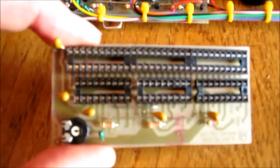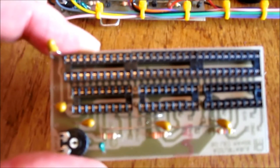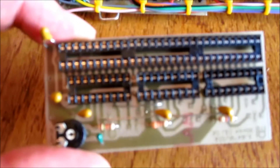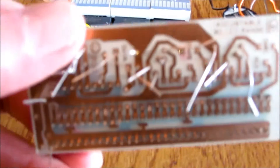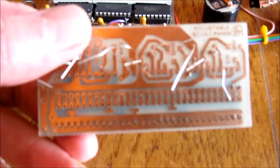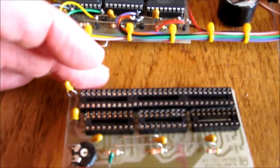This is a board I've loaded up already, and obviously you start off with the IC sockets for the drivers and the LED bar graphs. Only a few tantalums on there. Looking at the rear of the board, it's quite fine so you will need a fairly fine soldering iron. There's not much distance between some of these solder pads, but if you take your time with the magnifying glass you should be ok.